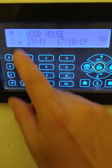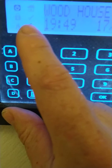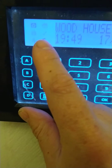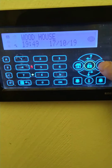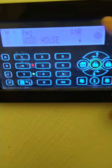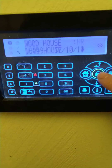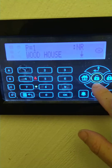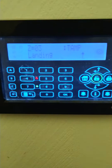As you can also see, the tick icon just above is not highlighted at the minute — it's not lit up. So if I went to try and set my alarm now by pressing the full padlock, it will come up with a triple beep and as you can see it says NR for not ready. When I press the down arrow as it's asking me to do, it'll tell me why. As you can see, NR — press the down — it says zone 3 landing is in tamper.